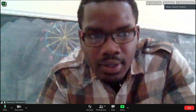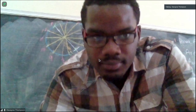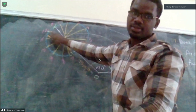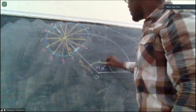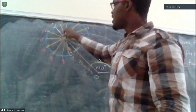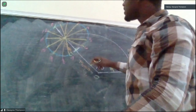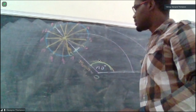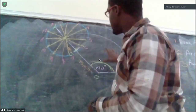Oh, wait. You're saying that yours match up based on the angle that you draw, right? Like, for example, this line passes directly to the 12th point? Yes, sir. Okay, yes, because since you're using a 120 degree angle, remember that mine is a sketch, and because mine is not at the angle, it wouldn't have been correct. But if you are doing it precisely, it would perfectly match up. Understand? Sorry about that. So yours would directly pass through because yours matches to the 120 degree angle.